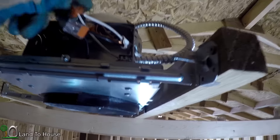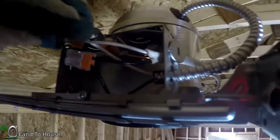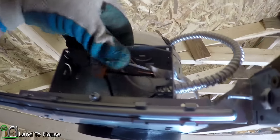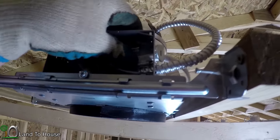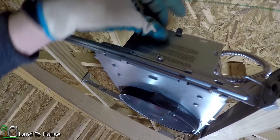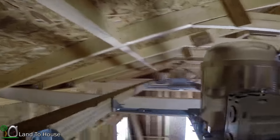Here's a close-up of what this looks like. Each of these just has a place you can slide the wire into, and you can see it up in this clear piece so you know it's there. Then I'm going to push this into the box. I need to fold this tab back — it kind of holds the wire in a little bit. And lastly, reinstall this plate. That completes the installation of the can light.